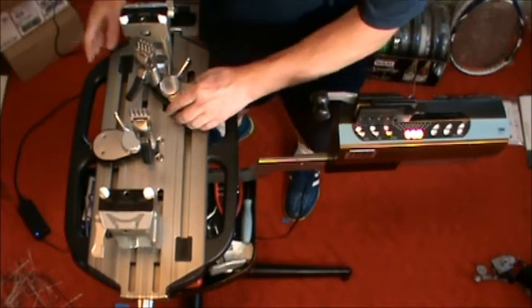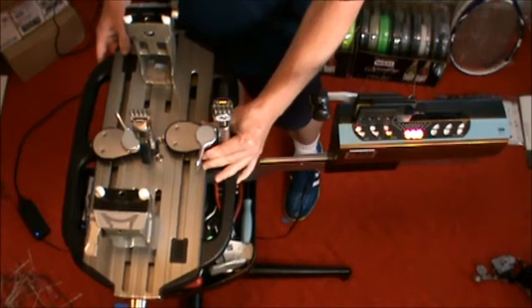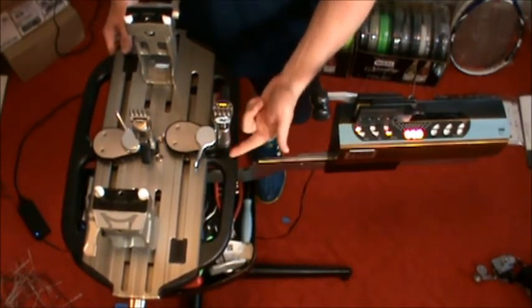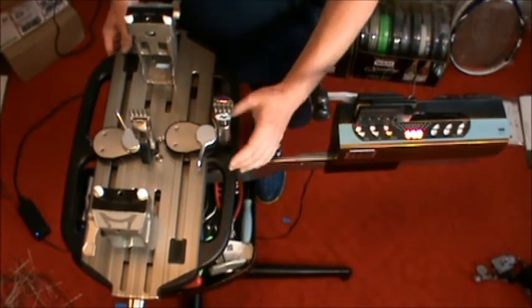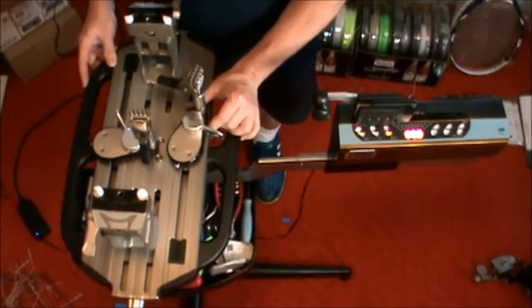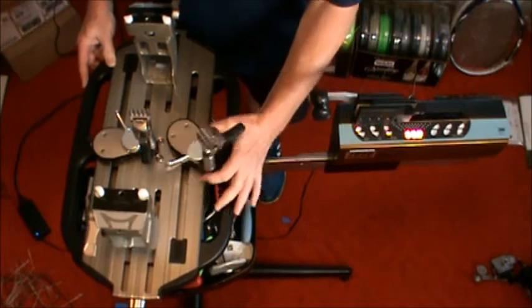Now the reason that I'm choosing to use this base clamp that's on the far side of the turntable and not this one here, which is closer, you might be thinking, well, can't you just orient this one the same way? Now the reason that I'm pointing this part of the base clamp at the tension head is when there's tension pulled on this, even though this is going to be locked in position, I don't want there to be any possible twisting of the base clamp in the track.